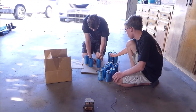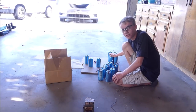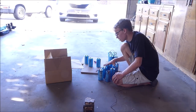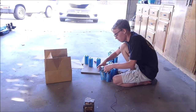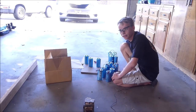So I went back to the electronics warehouse and I bought 10 more capacitors. Now we have a total of 18 capacitors instead of just eight, with a total of approximately 2,400 microfarads, which means this entire capacitor bank should be about 1.2 kilojoules — pretty fun to play with. This can make railguns and all kinds of fun experiments and explosions. We also need to build an enclosure so we don't have to keep lugging it around and make it semi-portable and easy to access.